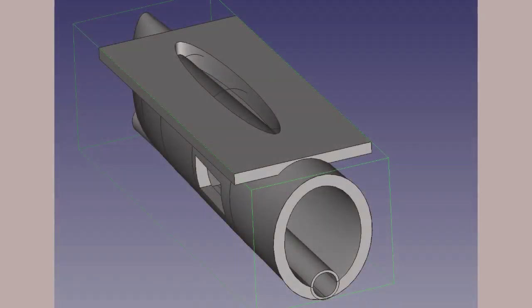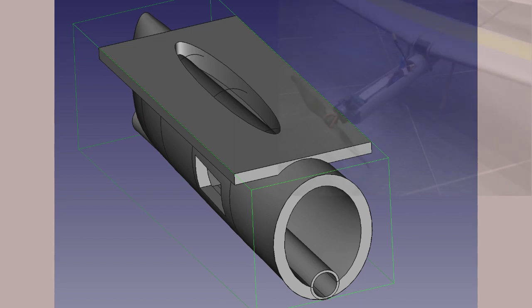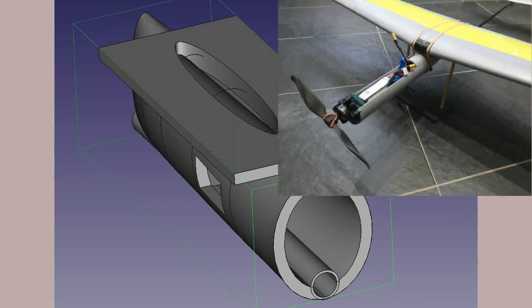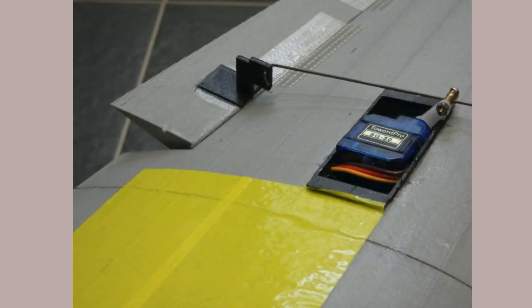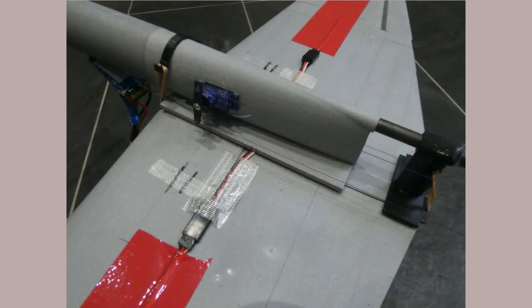I also took the oval PLA fuselage and redesigned it for printing with lightweight PLA. So it's got slightly thicker walls, but I don't really trust lightweight PLA for holding the servos, so I designed a PLA insert for that, which glues in between the shear webs. There is both a mechanical differential and a transmitter differential for those ailerons. On the underside of the wing, there's a shallow slot for the servo wiring.